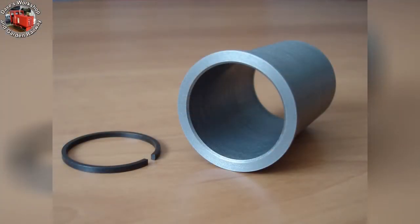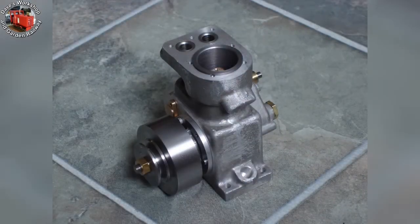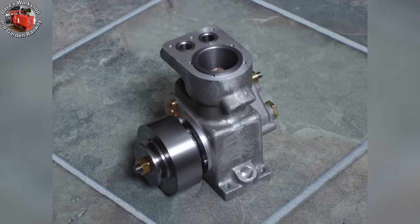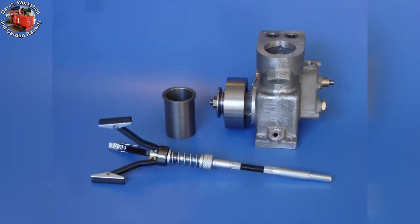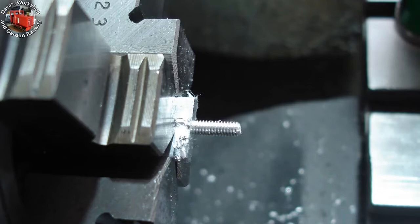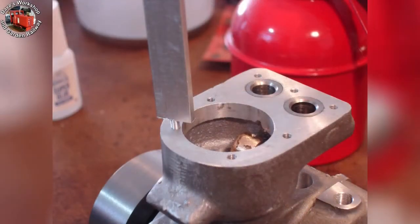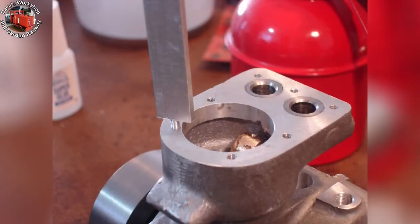Here is the finished cylinder and a supplied piston ring — looking quite finished, with the oil hole in the top of the connecting rod small end. The camshaft is fitted but not the gears yet. Making 6BA threaded sections to plug the cylinder head mounting holes in the main body casting — I did not have any suitable round stock. I loctited the end and screwed it in, then cut off the excess. Three holes needed plugging.